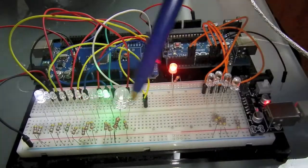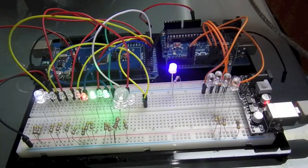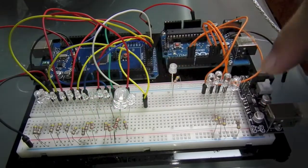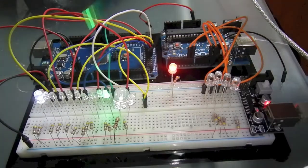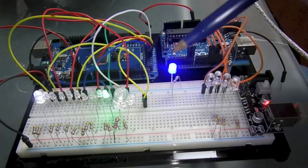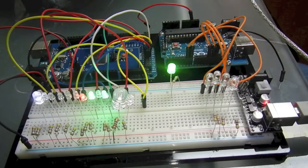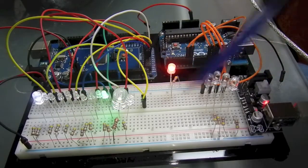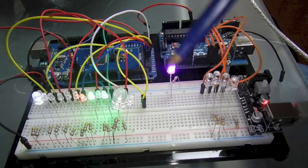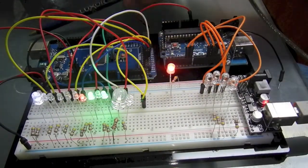Now, I have it hooked up. This is just if you plugged it in with no controlling circuitry at all, this is what the circuit will do. Now the problem with the way I hooked it up is I have a power supply over here which I can turn off and turn on. That power supply is used to just give it power. So if I switch this to being controlled by either switches or the serial control, I would run it here and have the control off board. In this case, I'm talking to it serially, so I need to connect up to the actual Arduino with the USB port and simulate this serial connection.